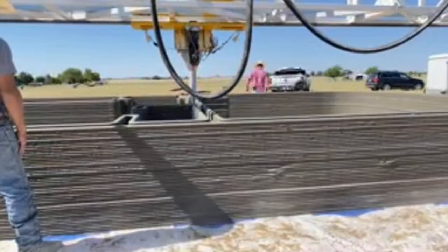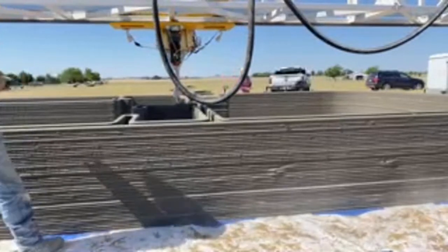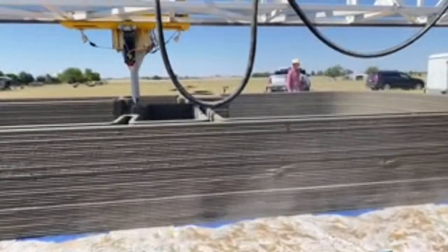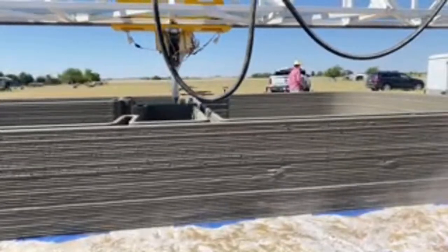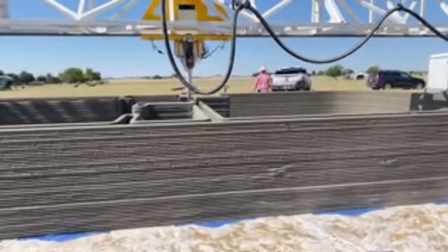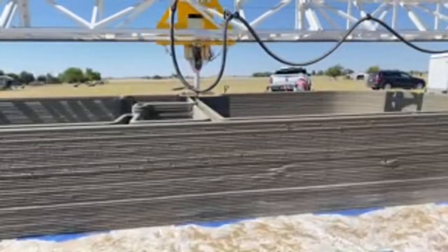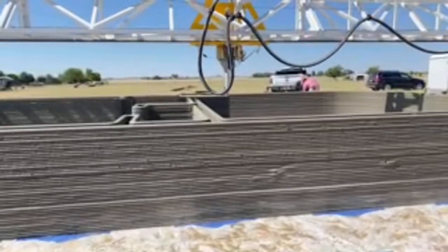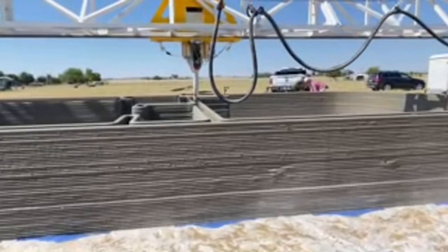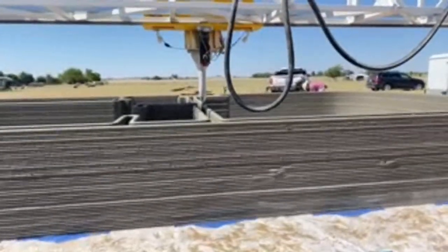Some kind of lightweight foam is often used as the insulation instead of backfilling some kind of loose fill. How will you guys do the insulation for this project? So insulation, we have a lot of different options that we can use. My background is heavily in HVAC and building science, so this gets me excited because there's no moisture movement through the material and we can basically create any cavity size that we want. But just due to the fact that we are in a hurricane flood prone area, I do want to do a closed cell. That way if it does get wet, we won't have that issue inside the walls and any accessibility issues as well. There are some other materials that we can use, but that's kind of what we got our eyes on.